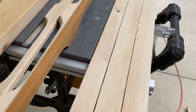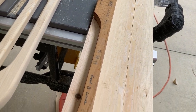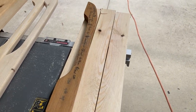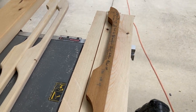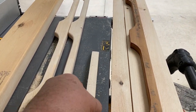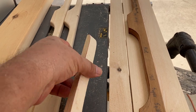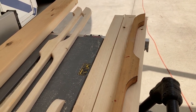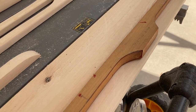I cut four blanks out, and you can see it's got some knots in it. But what you can do is cut around them, because when you lay your pattern on there you're not going to be using that area anyway. Same with this next piece — it's got a little knot up there, so that's going to get trimmed away as waste. You end up with a little cutout that actually makes a pretty good hand grab to put on either side of the top of a Sunfish daggerboard — that's probably what Alcort did, since they were way ahead of us in optimizing lumber use.